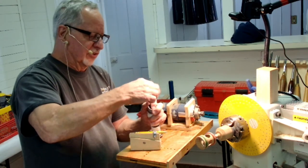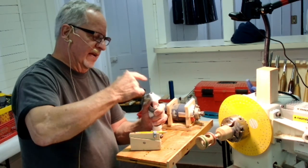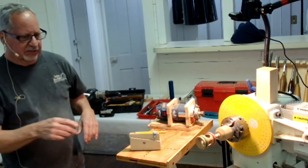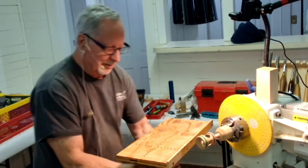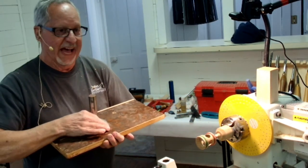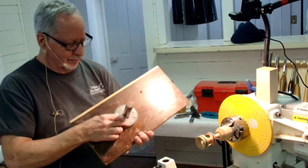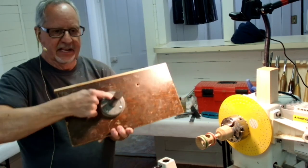So, yeah, this goes underneath here, on that rod. And to make this faceplate, there are a bunch of ways to do it, actually. You could make this out of wood. It obviously won't last as long if you do that. But what I did was I cut threads in this and threaded it into that piece right there.